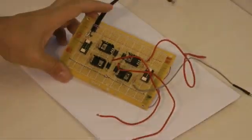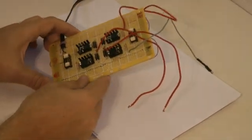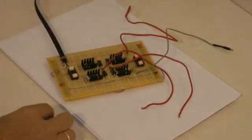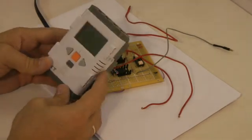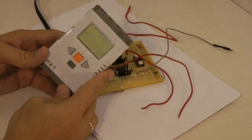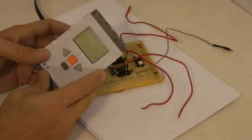Tonight we're going to build an H-Bridge. An H-Bridge is an electronic circuit that you use to control a DC motor. In this instance we're going to build this H-Bridge to interface with a LEGO NXT brick using opto-couplers, so it won't hurt the electronics of this device.